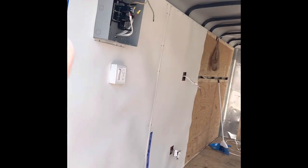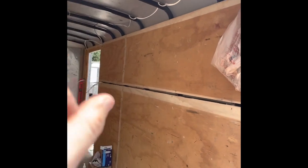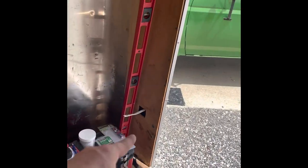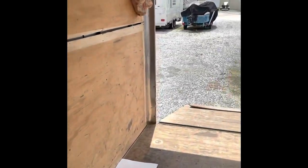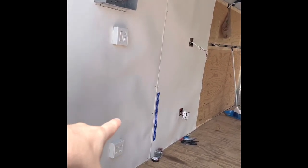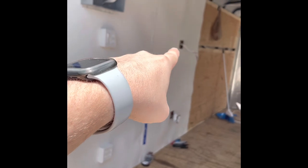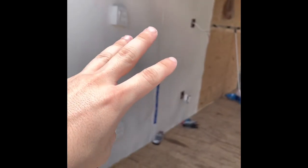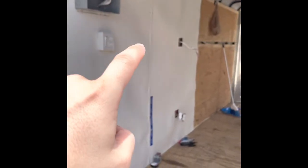The first circuit runs overhead and will power the lights — on the roof and exterior — and the water pump down here, plus an additional outlet. The second circuit powers my prep fridge and the exhaust fan overhead; the outlet for the fridge is right here and the fan is over there — I haven't bought the fan yet. The third circuit is a home run straight from the panel to an outlet for the food warmer, which draws the most electricity, so it gets a circuit by itself.